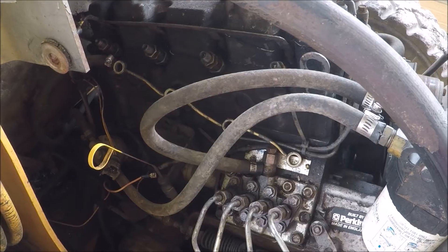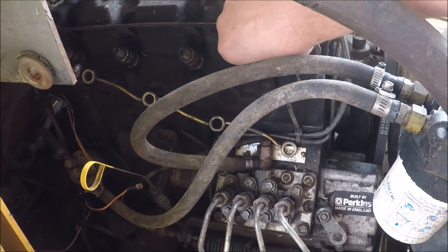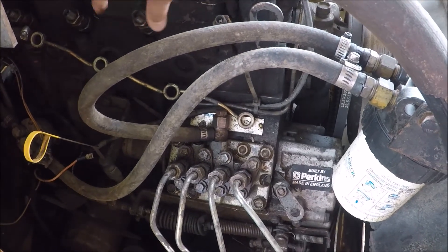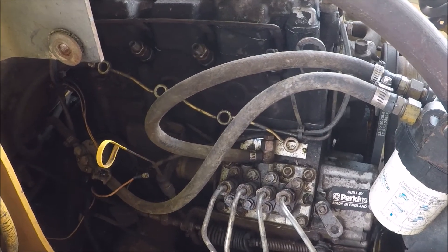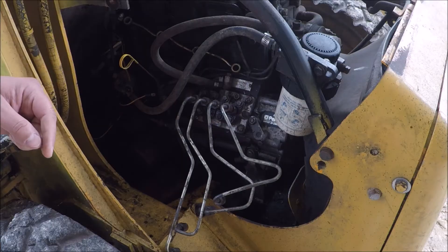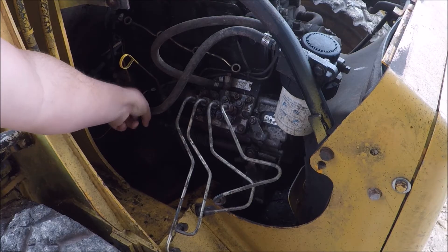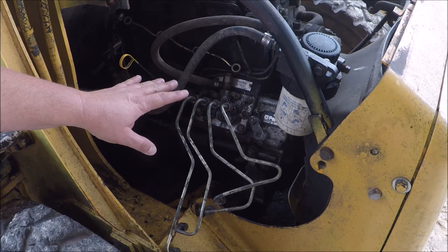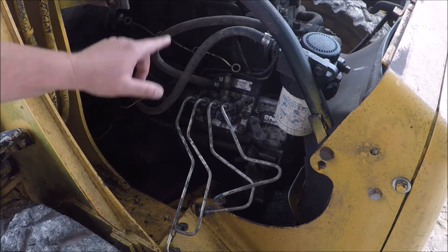This is a Perkins 4-cylinder diesel and I've already got the injectors broken down and hand tight. They're in here — I just put them in so that no garbage would get in there. I'm going to take those out and run a quick compression test on each one of those cylinders to make sure they're getting at least 400 PSI. One note: when you're doing these compression tests, you want to unplug the fuel solenoid on the fuel injectors, because that's going to keep the fuel shut off. You don't want fuel squirting out everywhere while you're doing these compression tests.